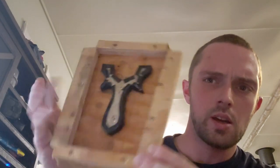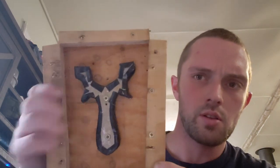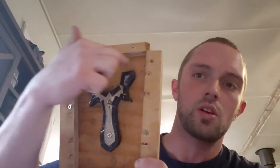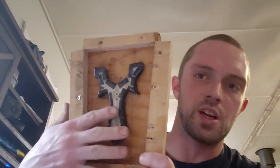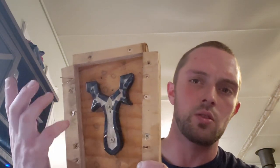I've made this little frame just out of plywood and screwed my mold into that. What I'm going to do is mix the cement, just pour it in there, squish it in, let it dry, and then pull this out — I might have to cut it out — but the void is what I will be using for my mold.